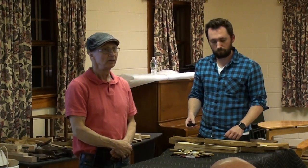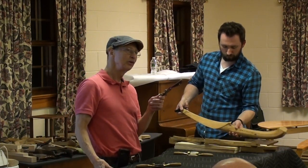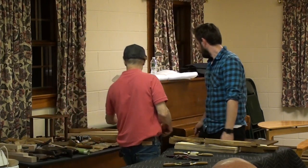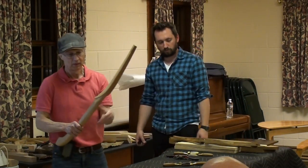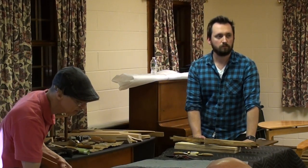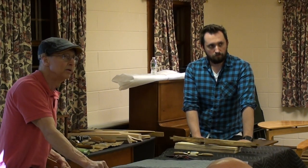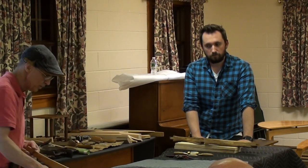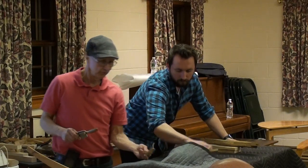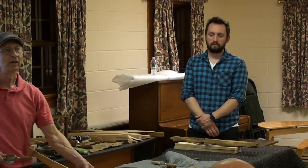For people who haven't shaped curved stuff: you start at the bandsaw. I do a lot with the bandsaw, and then a lot of times I'll set a spokeshave a little deeper — not real deep. When you're laying out the pattern on the stock for the initial bandsawing, you're not just orienting for figure or aesthetics — you're also thinking about which way you're going to have to spokeshave it. You always want to shave from the high to the low, not from the low to the high, at 99 percent.